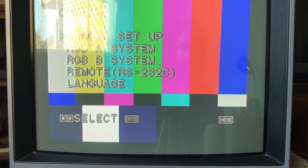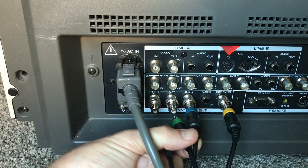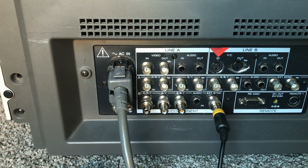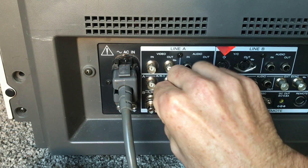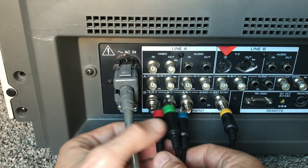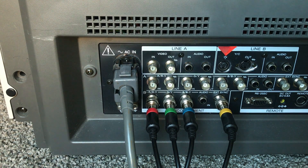In the menu here, you go into Config, then you can tell it whether you want RGB or component. You just switch between those two. On the back of the monitor, plugged in, you can see it says RGB or component. The RGB and component video go into the same slots because they're very similar signals. This cable is really cool — it will do RGB or component, and when you do RGB, it sends the sync through the composite line for external sync.